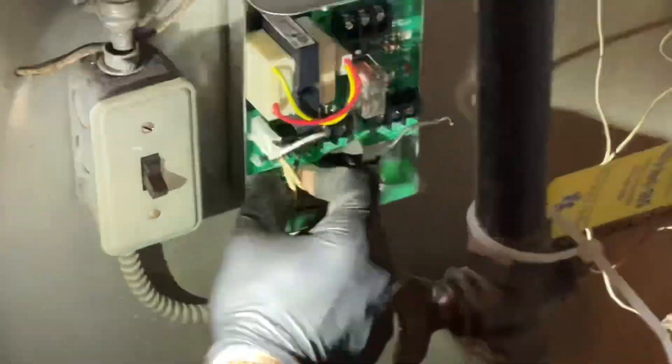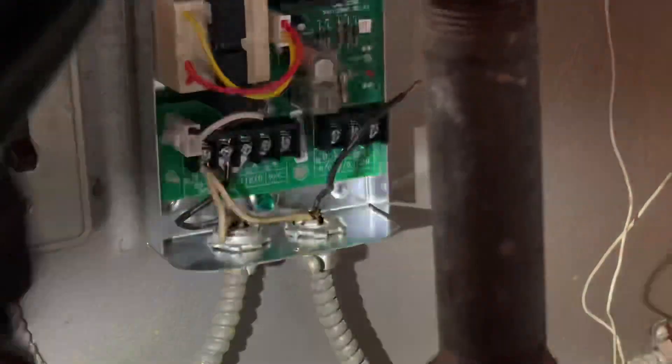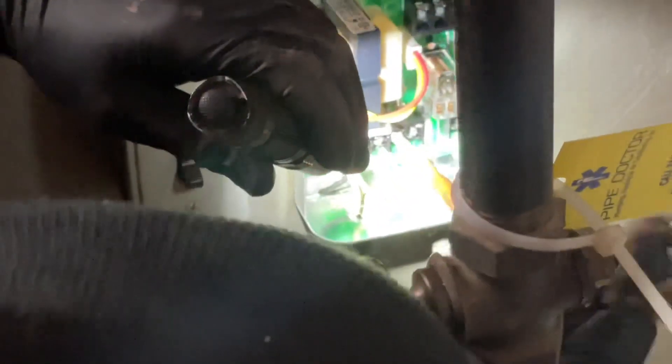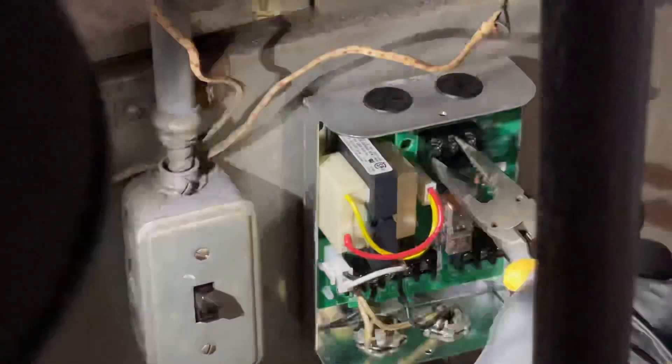So my two neutrals go together to N — neutral from the circulator, neutral from power going in. We have to look at the schematic. The circulator goes to number four — the one right there, which I believe is normally open. Number four, normally open — that's power. We're going to go to four, normally open, because it's not normally closed. When the thermostat calls for heat, then it will power. So if I did this right, the green light is on. And if I bypass TT, circulator circulates.